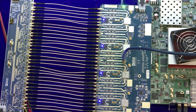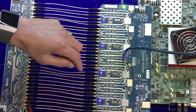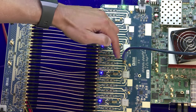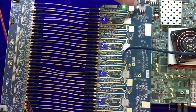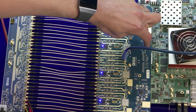The Quad MXFE board integrates four MXFEs. On the top of the board are the receive signals, which include RF amplifiers, baluns, and filtering. On the bottom of the board are all 16 transmit channels, which also include RF amplifiers, digital step attenuators for gain control, baluns, and filtering. Also on the top is the clocking — it takes a single 500 MHz signal onto the board, which gets distributed to PLL synthesizers to directly clock the MXFEs. A single 12-volt supply derives all voltages needed for the board, and micromodules are on the bottom for a multi-rail system. Digital interfacing is provided over a single FMC Plus connector.